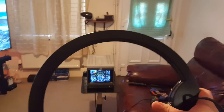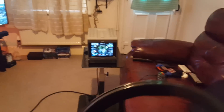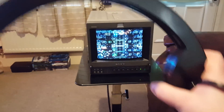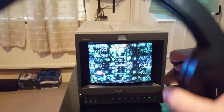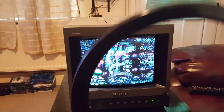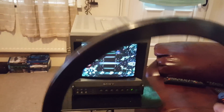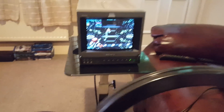Here's how you do it: start quite far away from the monitor and move it around in circles, gradually working your way towards the monitor. You'll see it start to affect the picture. Work it right up against the front and just keep going around in circles for a few seconds, then gradually move back away again — still going in circles — until you can't see an effect on the monitor anymore.